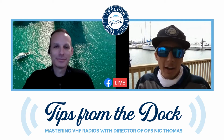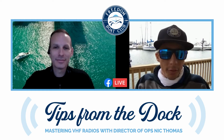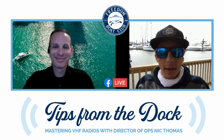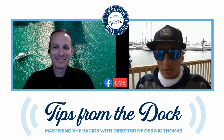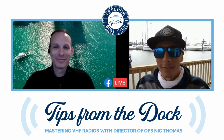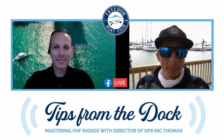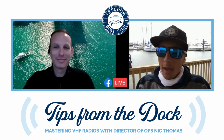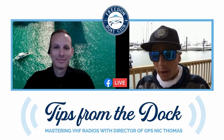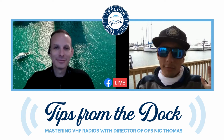And every radio has volume and squelch, and two of the most commonly misused features are these. People turn the squelch all the way up, and then you can't hear the radio. It doesn't allow transmission, so you want to keep the squelch as low as possible while still cutting out the static. And the other is people forget to turn the volume up when they're using the radio. Then they'll be hailing people, and they don't hear anything, and they wonder why. It's because they turned the volume down when they weren't using the radio, and then forgot to turn it back up. So those are two quick facts that will solve 90% of VHF radio issues right there.